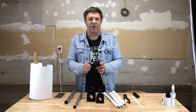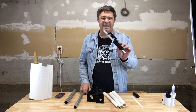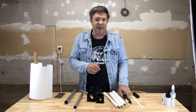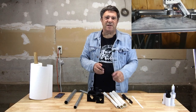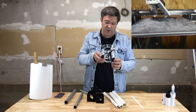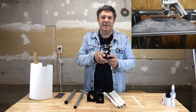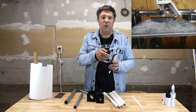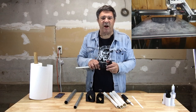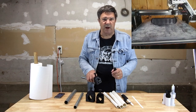For any pipe diameter larger than a 1/2 inch in diameter, you're going to find our mini hacksaw handle just doesn't cut it. It doesn't have the throat clearance to cut through the pipe. So we've included an STL file of what's basically the mini hacksaw handle, but with no knockout in the end where the beam goes. And the wide miter slot in our clamp actually provides ample guidance for the hacksaw blade, so the top hacksaw handle frame is not needed.